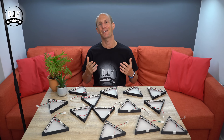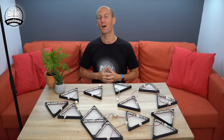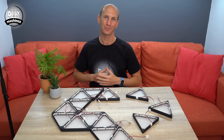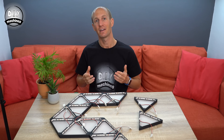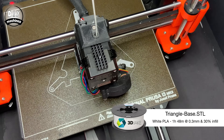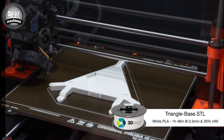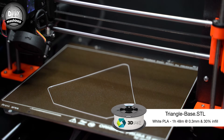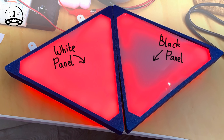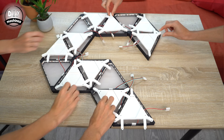Now you get to decide how you would like to lay out your panels. Don't forget that we're looking at it from behind at the moment, so your layout design will be mirrored once you've hung it up on the wall. Start with the first one's lead where you intend to connect the power and brains for the project later, and then make sure that as you add each additional triangle panel, its LED connector is up against the previous one. We can then print a base for each of our light panels — I highly recommend you do this in a white filament as this greatly increases the amount of light reflected towards the acrylic panel, giving us much better quality diffusion.